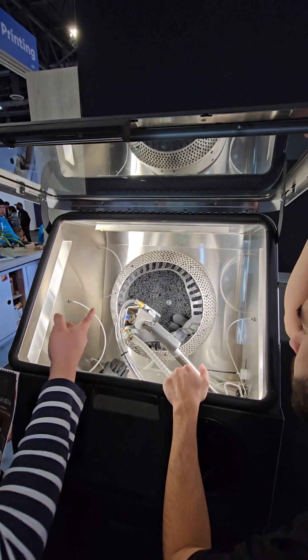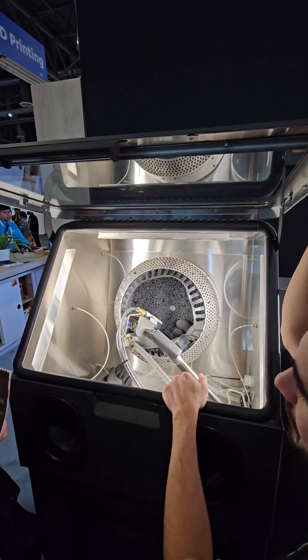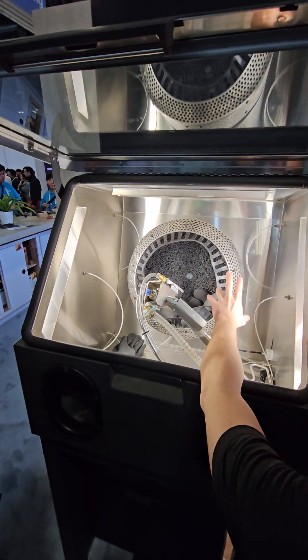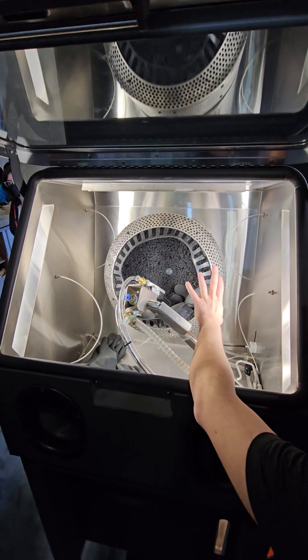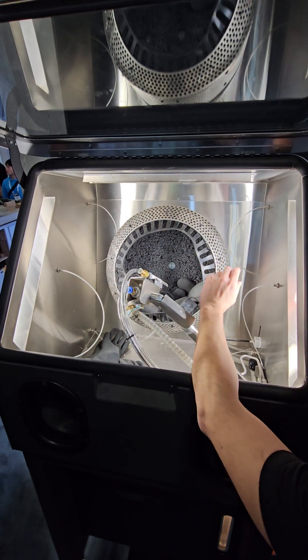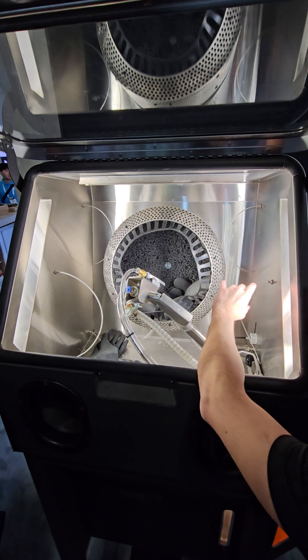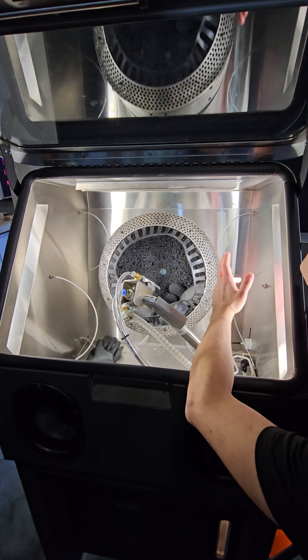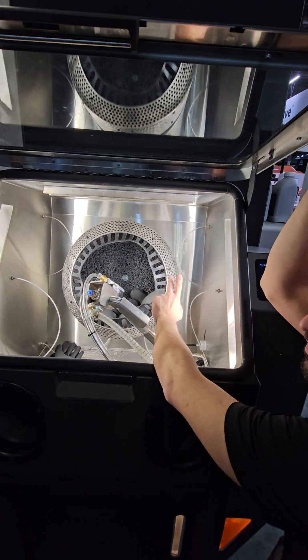Is there a charge on it or something like that? All of the plastic powder that you're taking off, as well as the plastic media, are both insulators — they're both going to get statically charged and stick to everything. So these de-ionizers are there to de-ionize the air and keep everything from getting stuck and clogged.